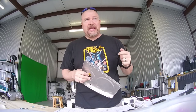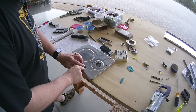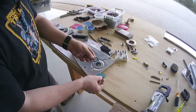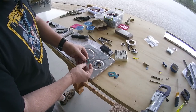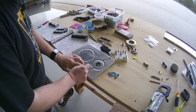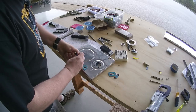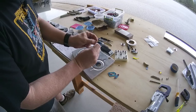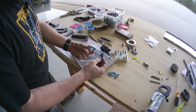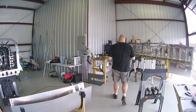It's a really beautiful day out but it is really windy, so I may end up closing my hangar. The first thing I need to do is take this piece and prep it — I haven't even taken the bluing off yet. These pieces come stamped and are really rough; I've got to go over to the deburring machine and really work this sucker over. It goes right here with these ports, but it doesn't fit right now — I need to make it so it will just slip inside there, and right now it doesn't even come close.